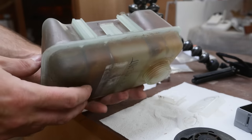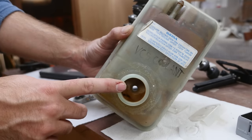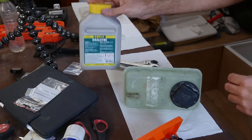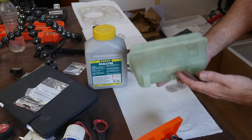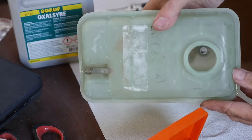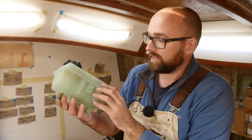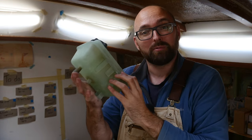There's a bunch of rusty crud in the expansion tank. I'm going to try dissolving it with oxalic acid. It took about an hour — I made a 10% solution of oxalic acid, let it sit for half an hour, then rinsed it out thoroughly, and this thing looks brand new. Maybe brand new is pushing it, but it's a lot cleaner than before. For those playing along at home, that is just shy of a hundred bucks saved — the cost of a new expansion tank.